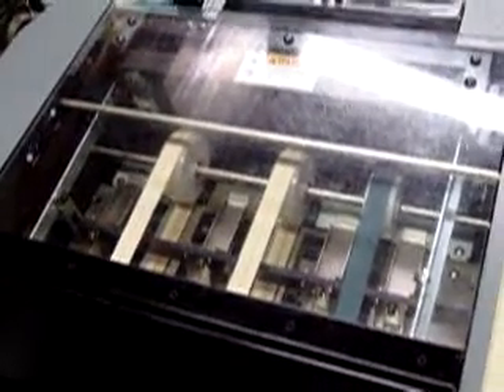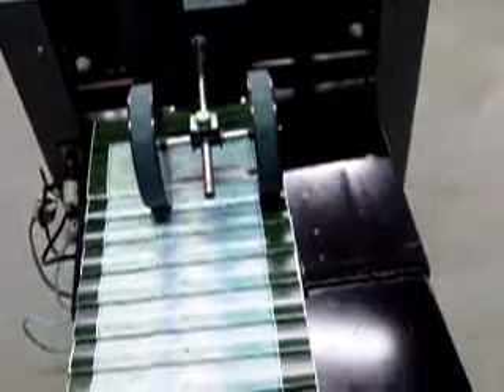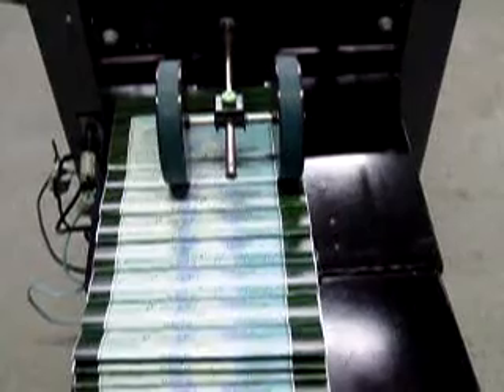It is just that simple and easy to set up a job and get going, and yes, it does move pretty fast. Essentially, you're taking a pre-collated set, pulling it off sheet by sheet, adding in a cover, then stitch, fold, and trim. You're doing about 1,200 to 1,400 an hour. That concludes our video. Any questions, please feel free to call. Thank you.